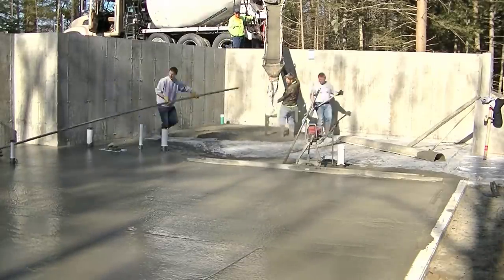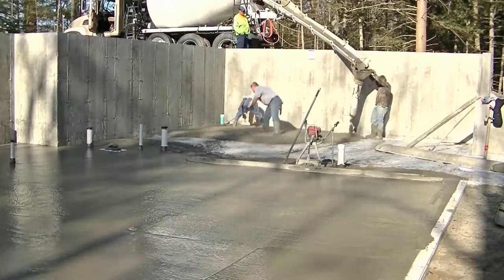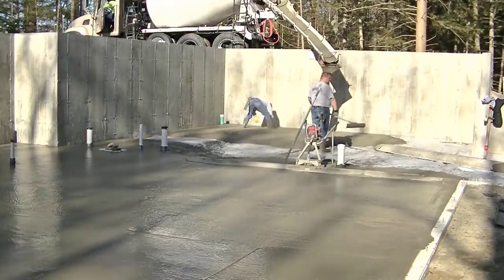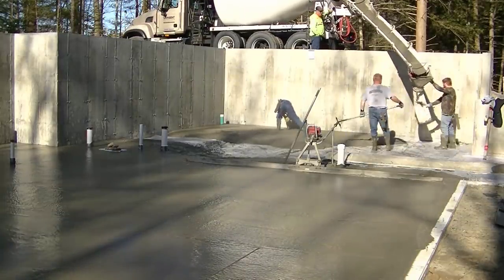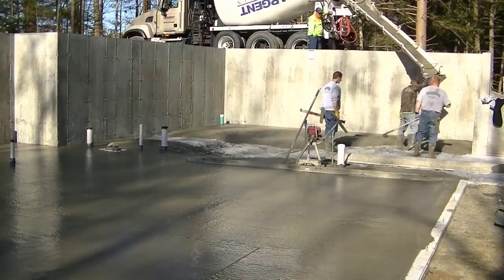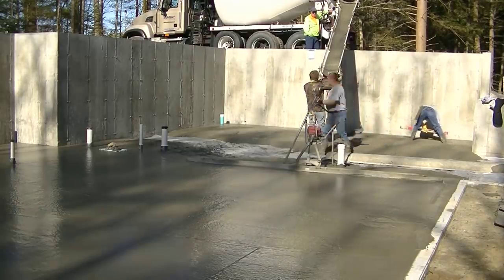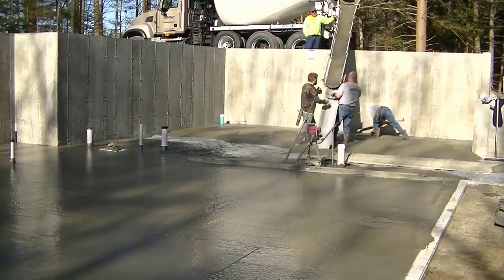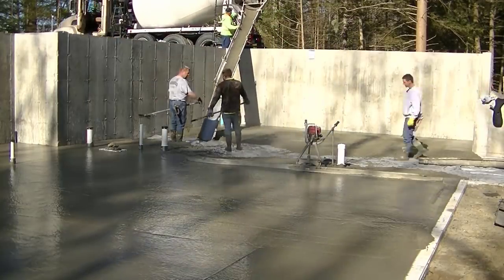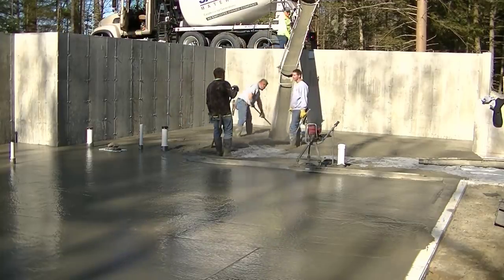I'm finishing up the bull float in there while Darren and Luke dump the second truck — that's where the garage is, which we'll be pouring right after this. Stay tuned for that next video. We pour well over a hundred — between a hundred and two hundred houses and garages a year, just the three of us. You can see me shooting that pad in the middle; the laser is key to pouring concrete floors like this. It speeds things up so fast compared to the old-fashioned transit, where one person had to look through it and another had to hold the grade stick. Lasers are the way to go — I've got one linked in the description.